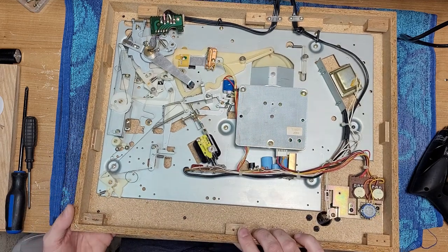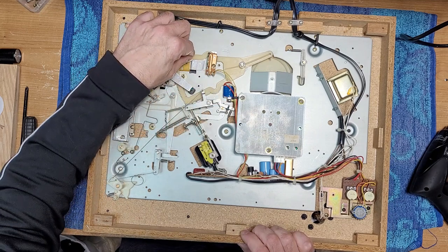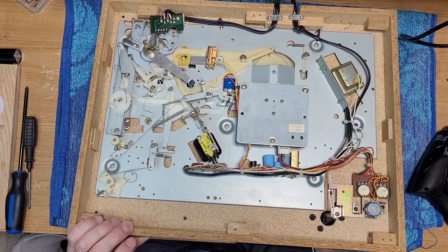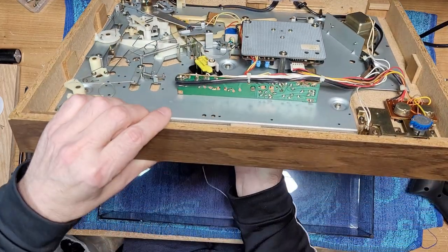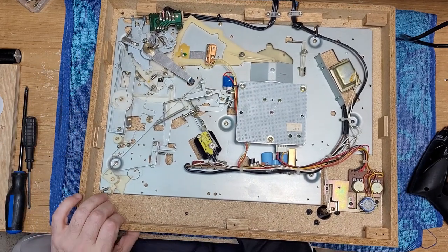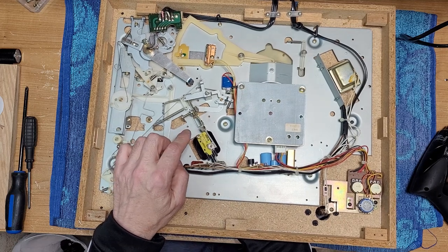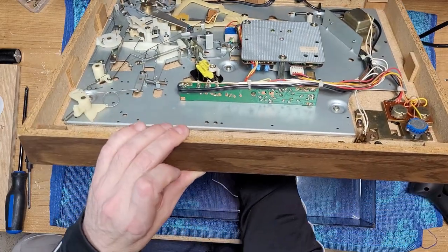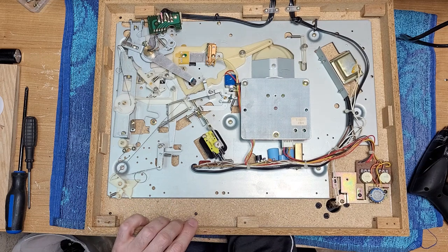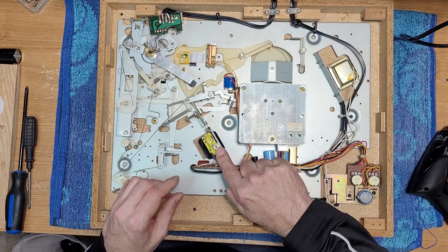There's quite a bit going on here. So that's our start. Kicks the solenoid here. This is our auto return. Just got to engage. Okay. So this moves the arm. And it's disengaged. This is in now. And if we turn it, there should be another click here. And as this comes back, it releases. It could be just this pivot point here that's a little sticky.